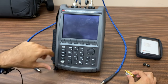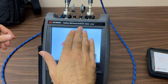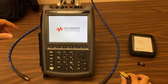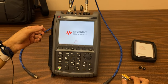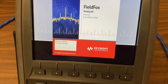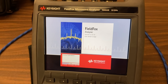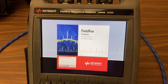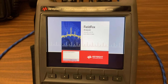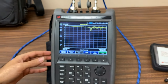To start the measurement process, we first need to turn on the network analyzer and begin calibration. You can see the model of the network analyzer we're using here — this VNA can cover frequencies up to 32 GHz. If you're interested in learning about detailed calibration, you can subscribe to our channel and watch our instructional video on calibrating the device. Since calibration is critical in the measurement process, we'll start by quickly calibrating here.